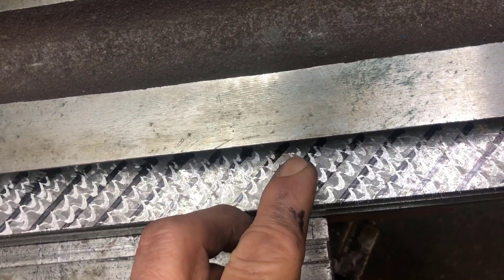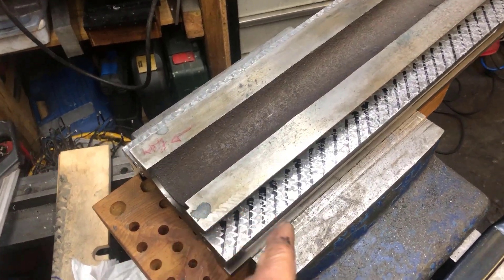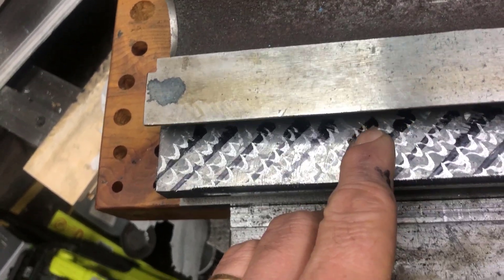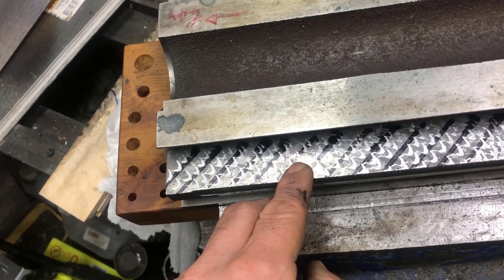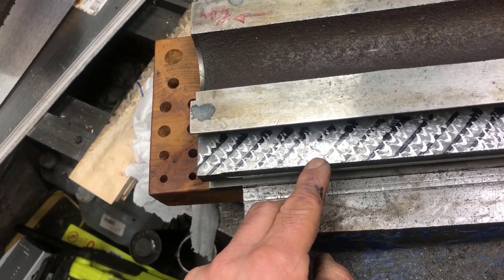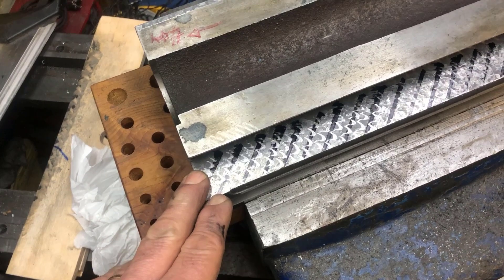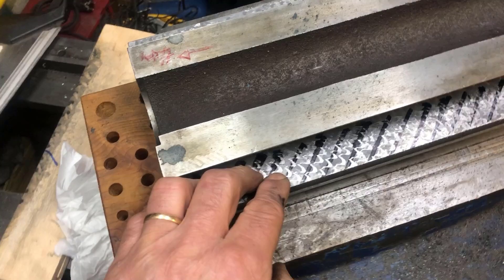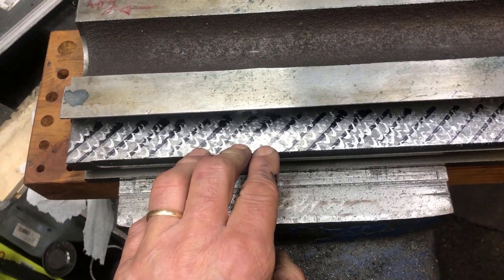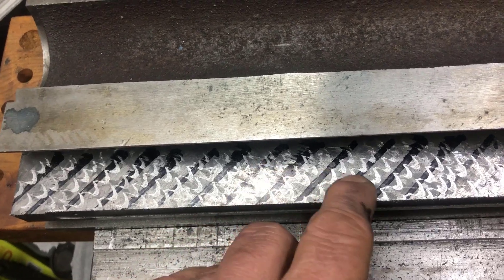I think it proves that you can do this without the Biax flaker also. The purpose is to retain the oil within these wavy patterns, so that the oil will stay there for a longer period of time. But caution — as I've learned, this will probably take away roughly half of the scrape marks, reducing support points down to about 50%, so be aware there is a trade-off here. But the point is that you will retain the oil better within these wavy patterns.